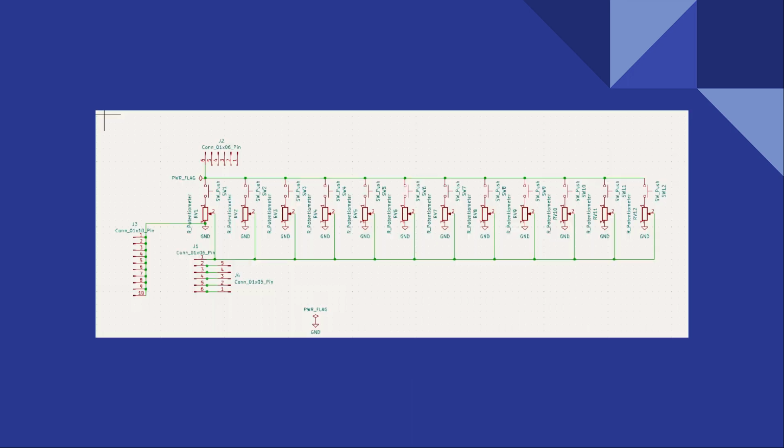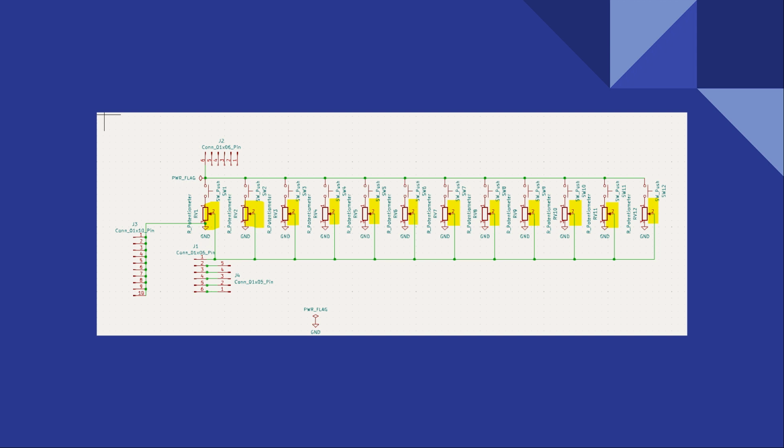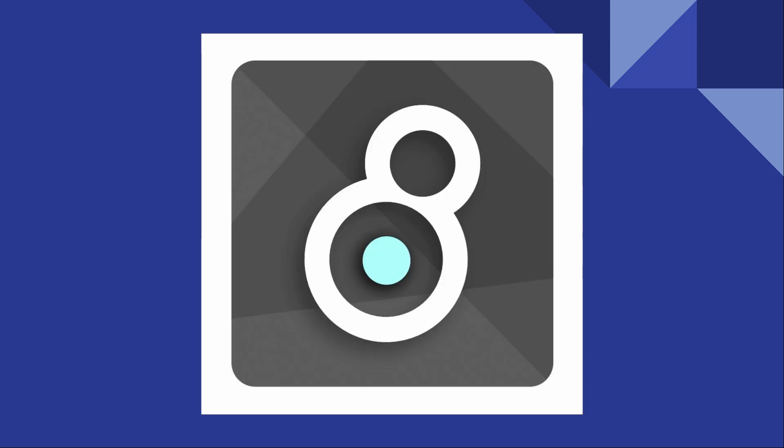The mechanical keyboard operates by means of 12 switches placed in parallel. Each switch has its own trimmer potentiometer, which can be used to finely tune the voltage at the trimmer's middle pin. This voltage is used as a control parameter for frequency in Max.